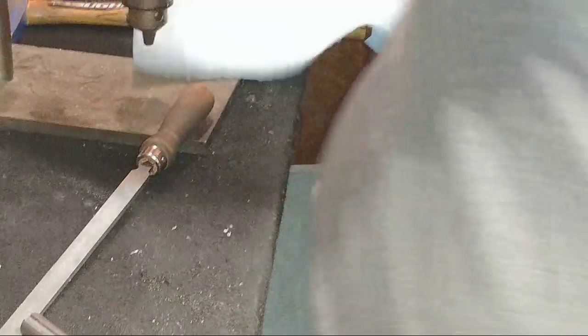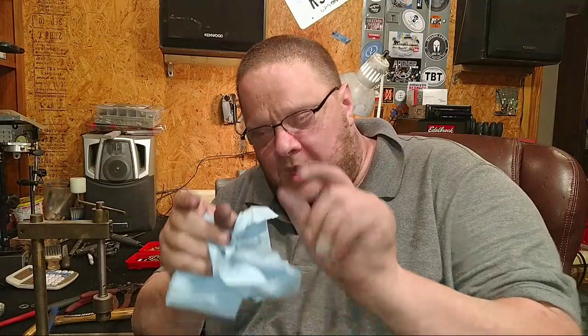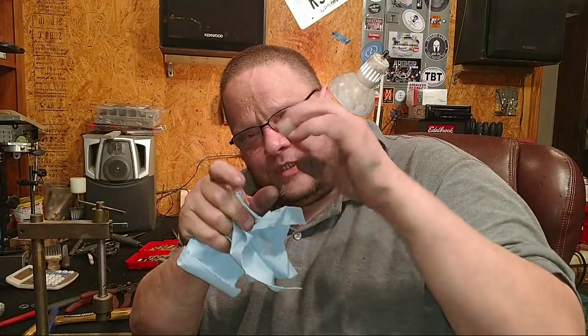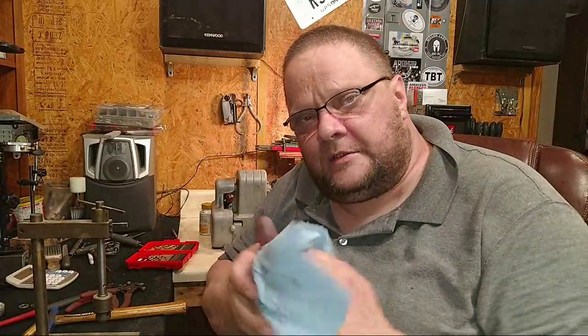So I zoom out. The original cross slide, the back part on the back side of the lathe next to the motor, is a piece of iron that has three bumps on it. One bump up next to the bolt that tightens it up, and two bumps that ride on the underside of the lathe. So you have just about a quarter inch wide and 3/4 inch long little bump that rubs under there. What this is, somebody put a piece of flat steel under there, and it grabs the whole 4 inches, so that when you tighten it up enough to take the play out of the cross slide, not even the power feed can... the power feed will turn the cross slide sideways and the nut will kick out.